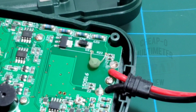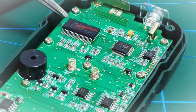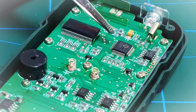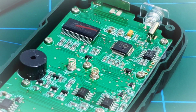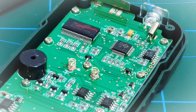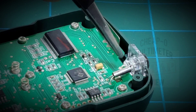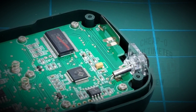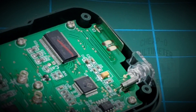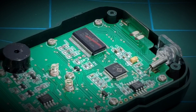Voltage input protection: not much — just one sad-looking PTC, so be careful around high voltage. Off the board we have the piezo speaker, above it the Holtek HT1621B LCD display driver, the main IC from Hycon Technologies the HY16F, and to the right the EEPROM 24C02B storing the configuration data. The single-LED flashlight is here, and the NCV non-contact voltage filament is protruding nicely, which likely explains the excellent NCV detection.